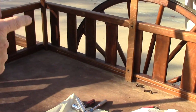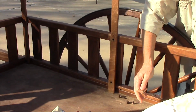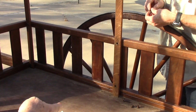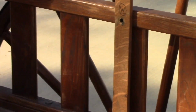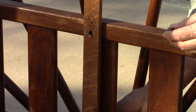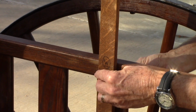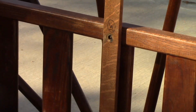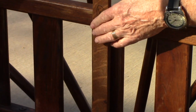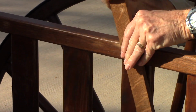So I'm going to talk while you put it. You got a washer for that? We had washers. Here. So a washer will go underneath the T-nut. Yeah, put it underneath the T-nut. And then from the inside, you'll put the bolt in from the outside of the frame. Yeah, do the top one. Long one. And see the washer on the T-nut? Show them how that is there, Scott. That's how the washer just fits over. And again, finger tight.